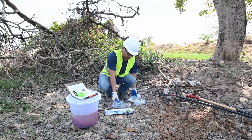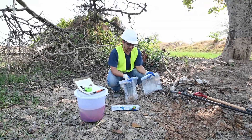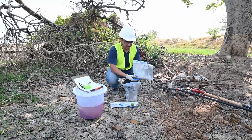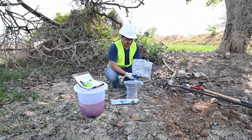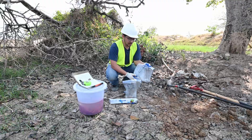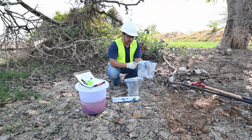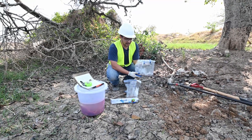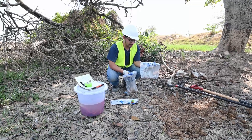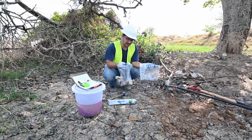Make sure you also bring sample bags with you and a permanent marker to write on the sample bag. These bags should be pretty waterproof, so generally Ziploc bags are preferred. Gallon size is good, and you'll always want to mark your project location, project name, borehole number, date, as well as the sample depth that you retrieved it at. On these bags I marked S1 and S2 just to indicate the relative depth, so S1 is a little bit higher than S2.